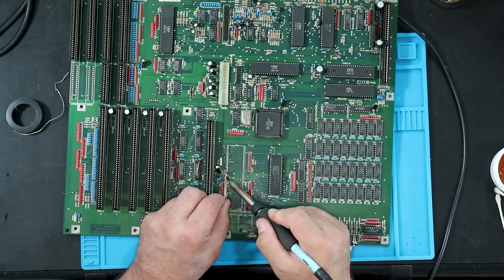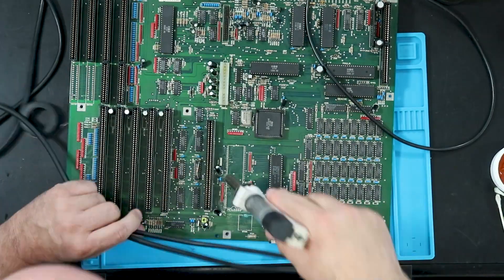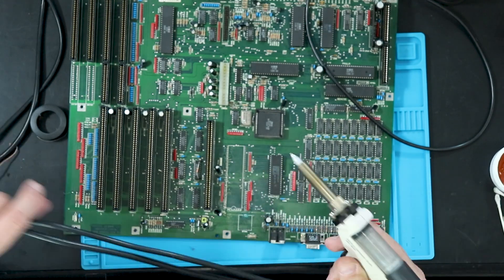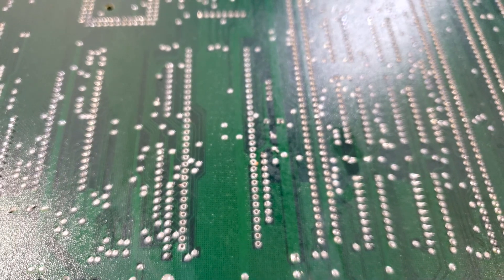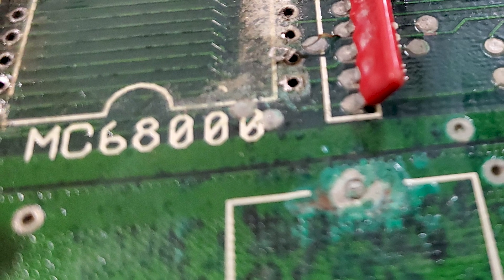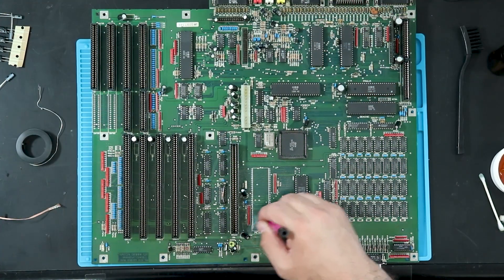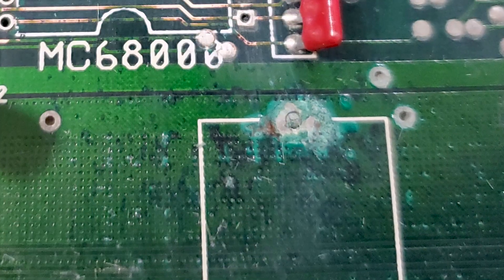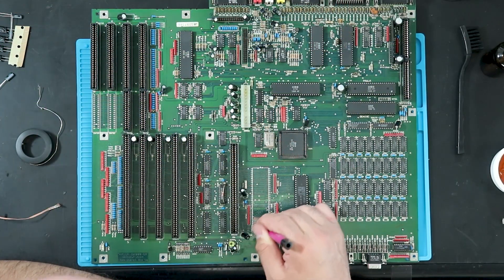After the socket was off, the pads on the board needed to be cleaned on both sides. It just takes solder wick and a little bit of patience. I am very careful that no pin gets heated for more than about 10 seconds at a time. Now the area can be cleaned with swabs and alcohol and we get our first unobstructed look at the condition of the traces. There are clearly issues with the traces under the socket nearest the battery, along with the area immediately around the battery.